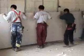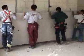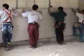I'll just zoom in down the bottom here too. Notice how there's some packers on the ground. The packers on the ground are there to make sure that the actual sheet doesn't sit on the actual concrete. Gives it a gap at the bottom. So just use a knob cut of plasterboard there.